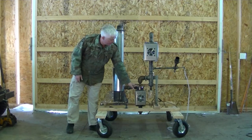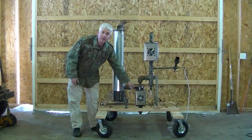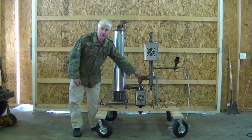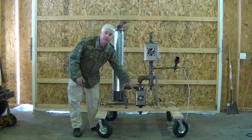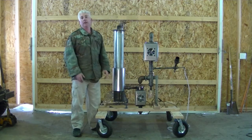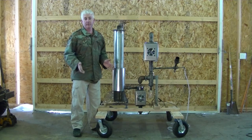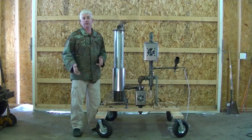Standard cyclone cooler down here. My goal is to bring the gas temperature down to 300 Fahrenheit by the outlet. Now, you notice I have this little jog — that's kind of new. What I'm doing there is I'm dry cycloning. I do not want condensation in the cyclone. After talking to Luke and Pascal last year, they challenged me to do a hot cycloning. I like the results. So from now on, everything I do is going to be hot cycloned — hot and dry.